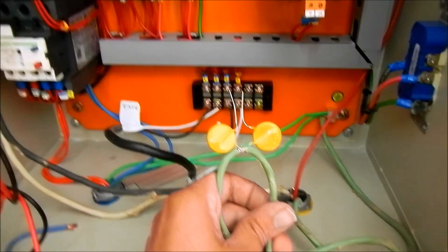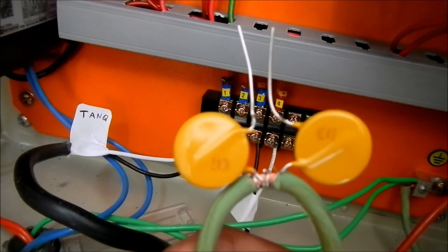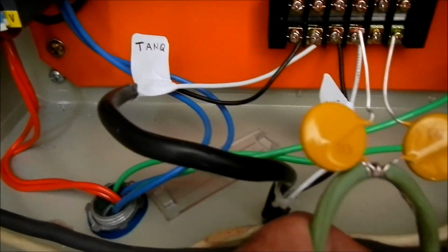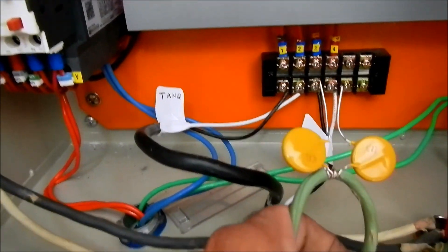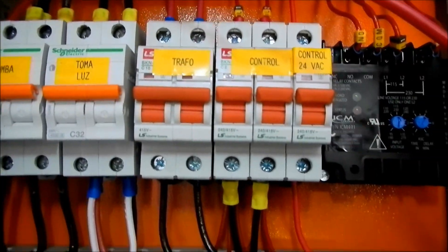What I'm doing here is installing two metal oxide varistors, each rated at 300 volts. They're going to go across the 24-volt AC supply that feeds the float tank switch. There had been some lightning strikes at the float tank that sent a voltage surge down this float switch control line, into this box, and it had tripped some of these breaker panels.